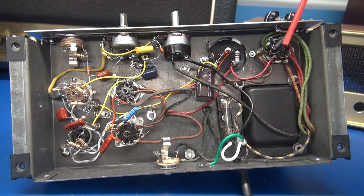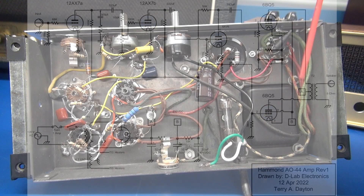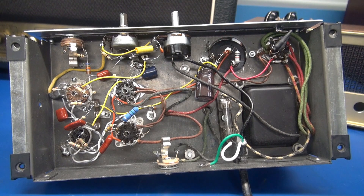This is very close to my original AO44 mod schematic that I did two years ago. The only additions are the tone control pot and a new filter capacitor. The old one referenced the original can-style cap that was on that chassis — when this amp showed up, that cap was gone, and I would have replaced it anyway. If you want a copy of this schematic, just email me. I'll send it right out so that you can modify your own Hammond AO44.